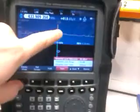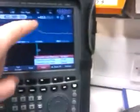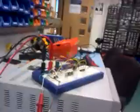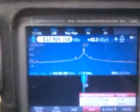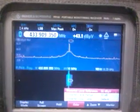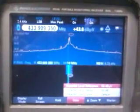So you can see here that we have a frequency here, and this is no good, because the frequency is taken up. And so therefore my other sensors wouldn't be able to transmit with that. So when I put my hand over the sensor now, you'll see that there's the increase. So that's when the sensor was triggered and when the sensor is not triggered. Sensor's triggered, sensor's not triggered. So we had a problem with the transmitter always on, so I introduced a NOT gate.